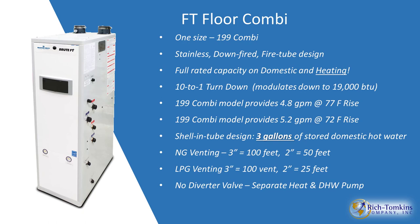There are nice things about this floor model worth pointing out. If you don't have the luxury of a flat surface to mount a boiler on — say you've got a stone wall or no space to cobble up a false wall — the floor model is the perfect application. The 199 combi can deliver 4.8 GPM at a 77-degree rise and 5.2 GPM at a 72-degree rise.